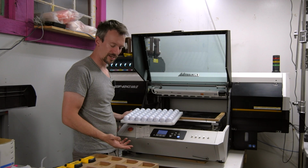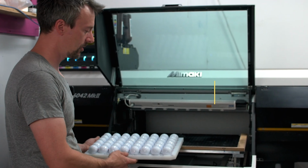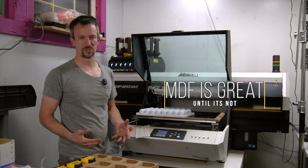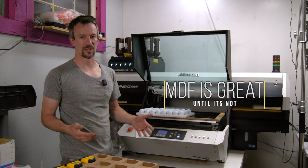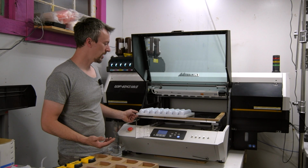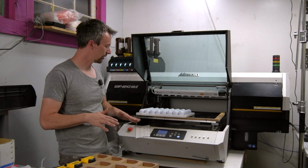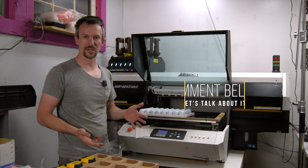Another thing I want to mention, we use a lot of MDF for our print jig material, and we found that the 1" is the best to use because it doesn't warp as much as the 3/4 inch. They won't sell it at Home Depot. It'll be like a building supply contractor. We tried UHMW, also had problems with it not being completely level. So if you have recommendations on materials that would work best, we'd love to hear it.